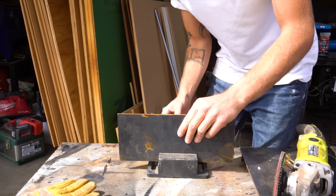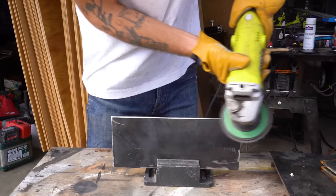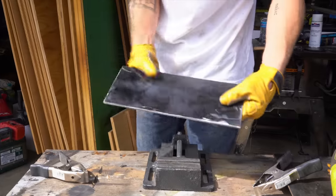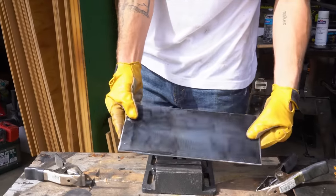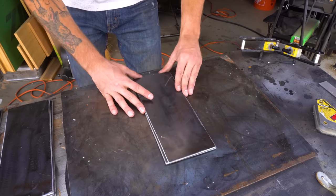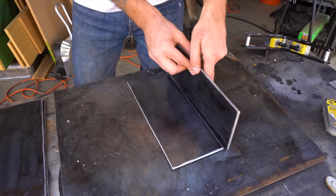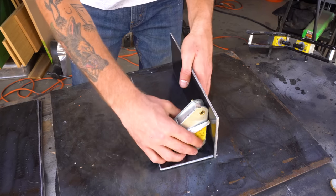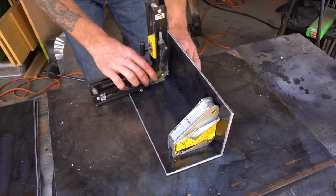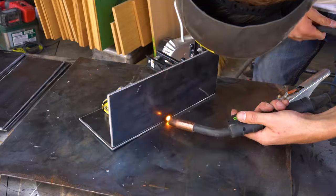The next day, I went over to Maker Ranch so that I could use the welding setup, and I started by grinding and cleaning up all of my metal. A flap disc is my go-to for this. You'll see I've got 2 size leg pieces, and one takes the thickness of the other into account because of this butt joint. If you don't know already, some good 90-degree magnet clamps are the secret to an enjoyable welding process. They're so handy, and I'll leave a couple links down below.